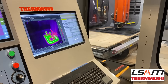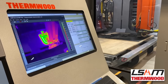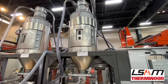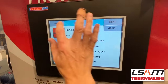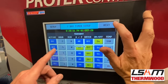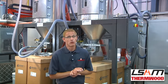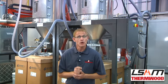The LSAM is equipped with a standard thermographic camera and feature-rich monitoring software that allows you to quickly ensure it's operating within the correct temperature range to achieve a good print every time. The LSAM utilizes pelletized materials, and for most materials to print well, they must be dry. Therefore, an industrial quality drying system with dual 600-pound capacity material hoppers is standard with our flagship models. Independent temperature settings and an automatic scheduling timer give you the ability to dry two different materials at the same time, allowing immediate switching between materials without waiting hours for drying. An automatic vacuum conveying system keeps the drying hoppers replenished and the dried material supplied for uninterrupted continuous printing.